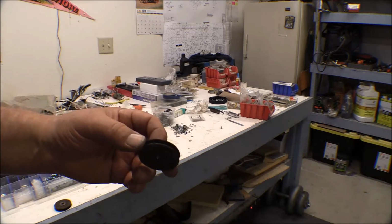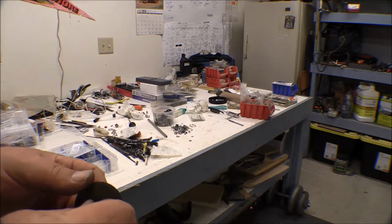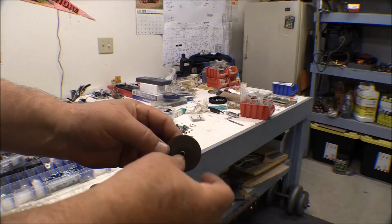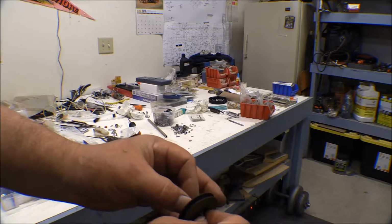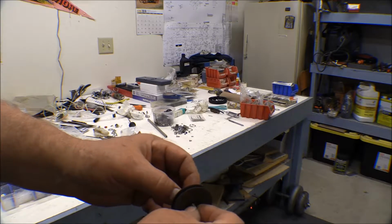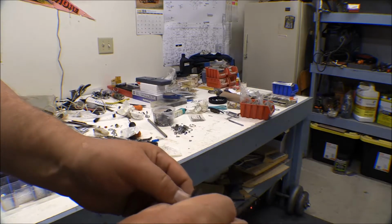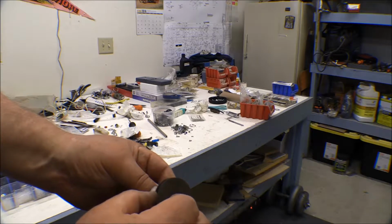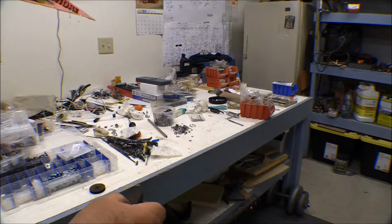And I got new pulleys. This is one of the old pulleys. They take a bushing that goes in the pulley. The pulley is a phenolic pulley, and then they have a bushing that goes in there. The bolt goes through there, and then this thing pivots on that bolt, and they get rusty, and the bolt gets rusty, of course, and they freeze up, and then the cable just slides back and forth on the pulley and wears it out. So I got new bushings, stainless steel bushings, and I got stainless steel screws to go in there to pivot on, and lubed them up.